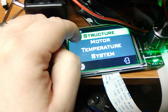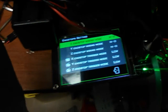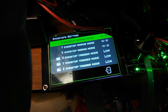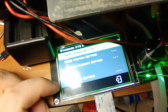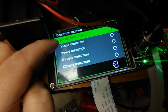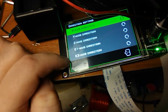For settings, go into Structure, pick Standard XYZ Machine, click Advanced Settings, then go to End Stop Settings. Each of these end stops is set up to trigger when they're low, because apparently that's what these end stops require. Scrolling back out, go into Motors and click Direction.